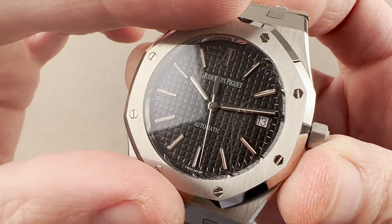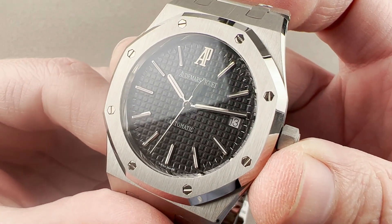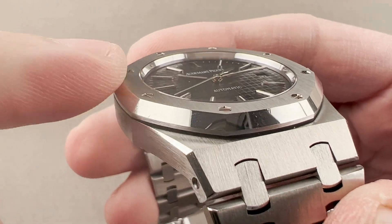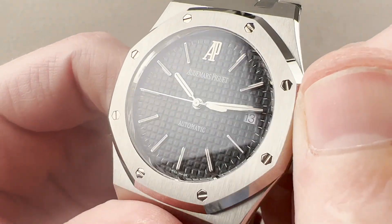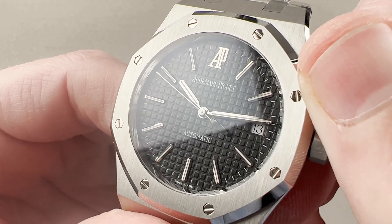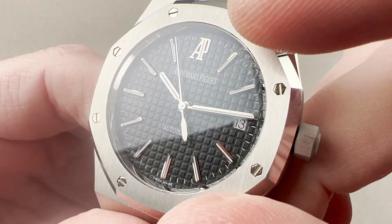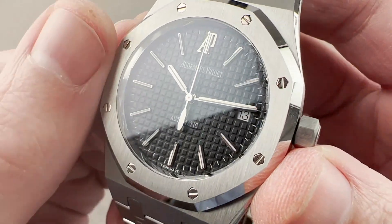The bezel in an octagonal rounded form was inspired by a vintage diving helmet — that's where Royal Oak designer Gerald Genta drew his inspiration. The outermost face is satinated, the large flanking profile is polished, and the top has vertical satination. The dial is the Grande Tapisserie: the large hobnail cut on a pantograph lathe, which is a 19th-century engine and a very old-fashioned way to make a dial. It has 20,000 tiny ridges that run over and between the larger hobnails, and then it's galvanized black.